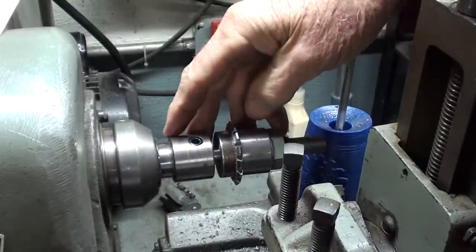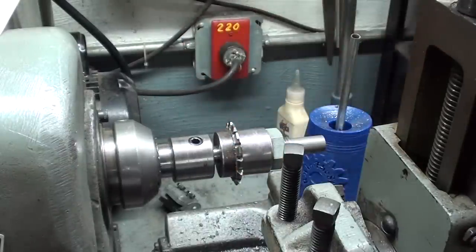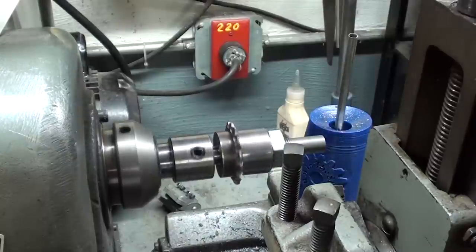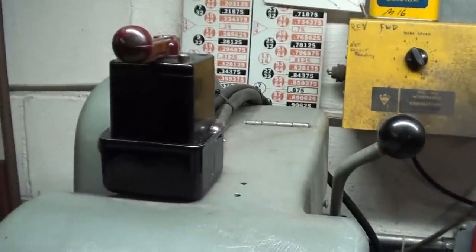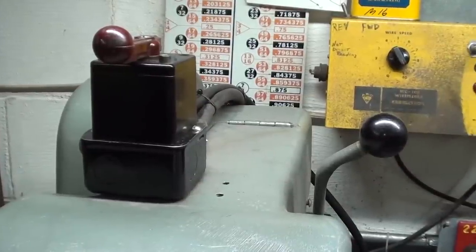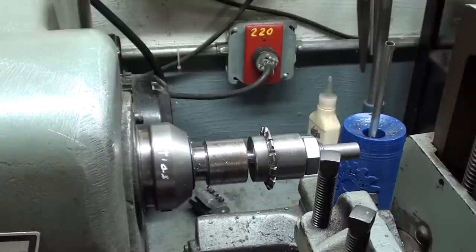The speed of the machine is set at 211 RPM because the cutter is one and three-quarters inches in diameter. That gives us an approximate cutting speed of 100 feet per minute — in that ballpark. That is back gears. I will be using the power cross-feed, and that is set at its slowest feed rate. Notice that the cutter is mounted backwards such that I need to run the machine in reverse. That is why I had that multi-part video on how to wire up this switch — in all the years I've had this machine, I really never needed to use reverse, but now I do, and in a minute you're going to see why.